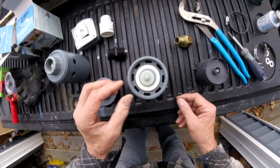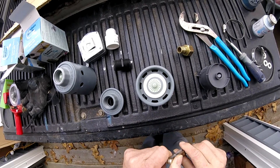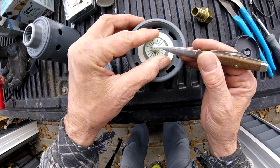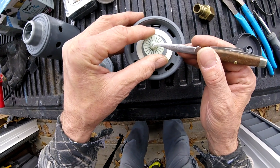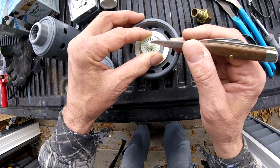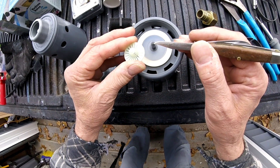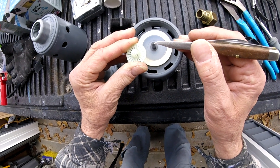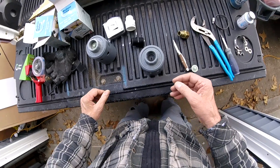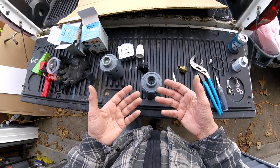You've got to keep dirt out of that small hole — if it gets clogged, the valve won't work. Now, about this strainer: notice that the center part is blocked off. Water coming in would hit this and have pretty much no chance of any dirt ever hitting that pilot hole.